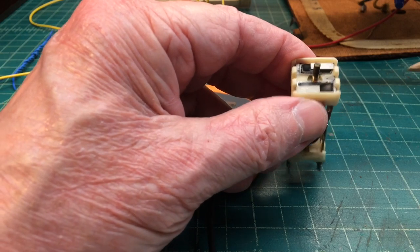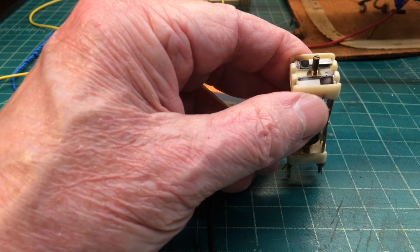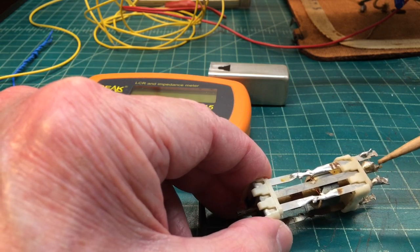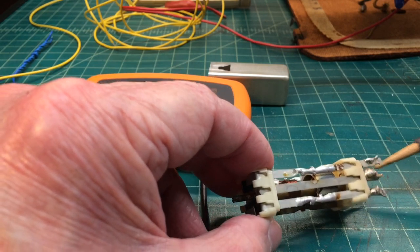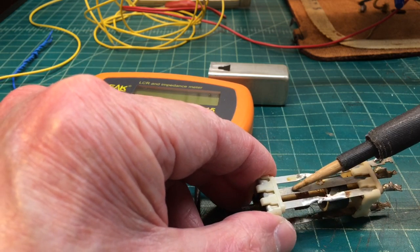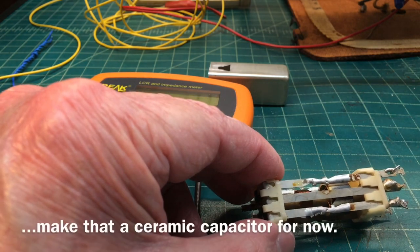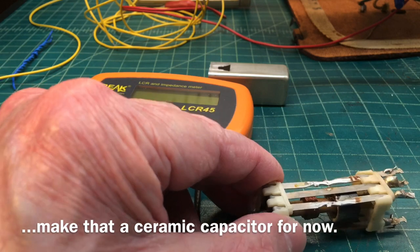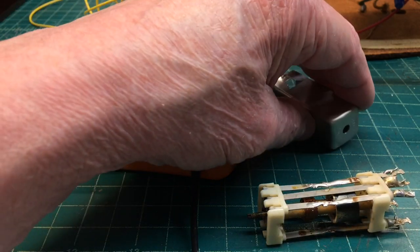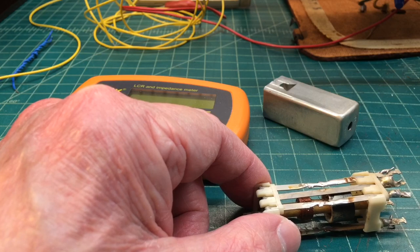To make that permanent repair, just go in here and cut these mica sheets out. I'll go ahead and do this off camera — I've got to clean up all this old solder that was on the transformers. Clean those up, dress those up, make a small cut here, and I'm going to solder another little mica capacitor in for right now across those two points, then try to get this back in the can.